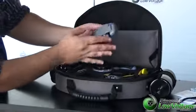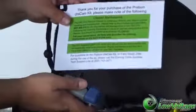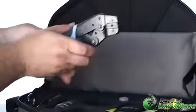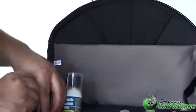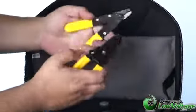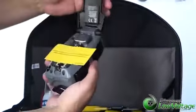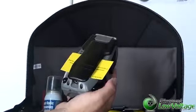Let's take a look at the tools. We have your cleaver — this is one of the most expensive parts of the toolkit. It's a precision cleaver and it will make your installation a lot easier. There's also a little thank-you card and some cleaver maintenance pointers. We also have fiber wipes, your crimp tool for your UniCam connectors, some cleaning fluid, some snips to cut the jacket and the Kevlar, a Sharpie, and a couple of different strippers — one two-hole to strip the cladding off the glass, and one to get the jacket off the fiber. There is also an installation tool included. You'll want to register this equipment to receive a free accessory from Corning, which is a good idea since it is a pretty expensive kit.